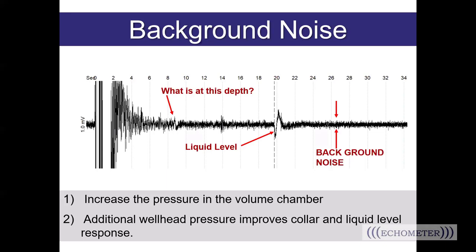You can also identify mechanical noise like noise from the pumping unit. Mechanical noise is rhythmic, coinciding with strokes per minute or another machine with repetitive operation. We always teach that you should shoot your fluid levels with your units running because once you shut down your well, you start changing conditions — one of the main reasons to shoot a fluid level is to learn where the fluid level is under normal operating conditions. A lot of background noise can be filtered out after the shot is taken by using the low-pass filter, but if the mechanical noise is significant and interfering with your analysis, you may need to shut down the unit to shoot the fluid level.